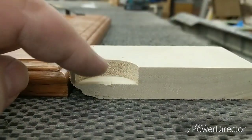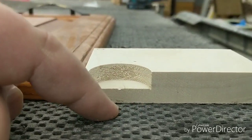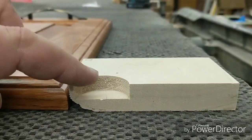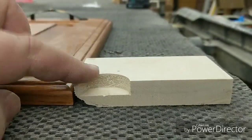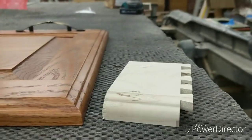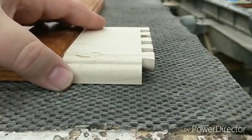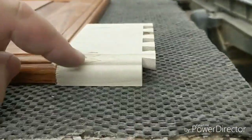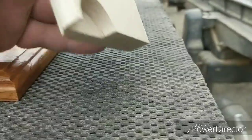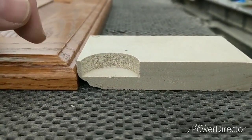The problem with that is my hinge boring machine references from the face. So from the bottom of the face to the bottom of the cup is always consistent. If I have a thicker door, the depth will be thicker. This door profile — when these doors were built, I had them sanded down to .770. I thought 20 thousandths would be extra, but it wasn't. I wish I would have kept another 15 to 20 thousandths thicker. The profile is really close, it's just a touch shallower. But the problem is this cup depth is no longer 7/16ths — it's about 3/8ths of an inch.